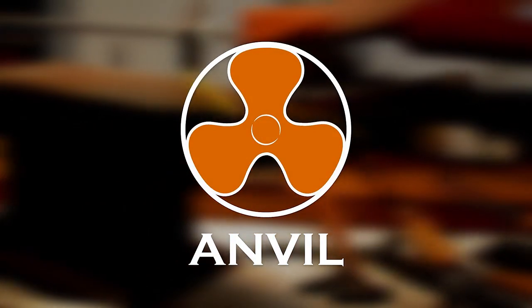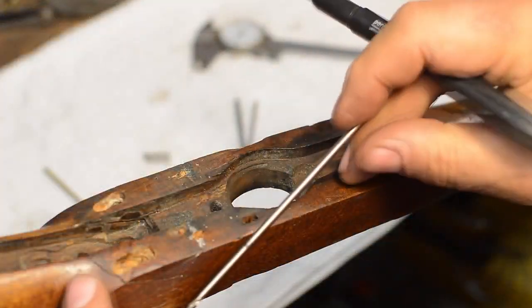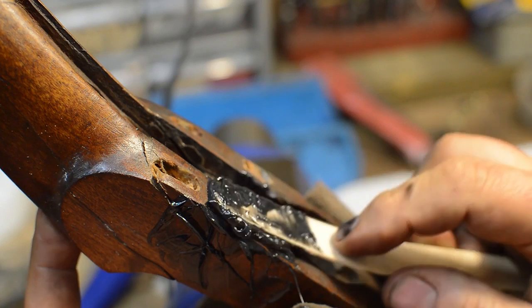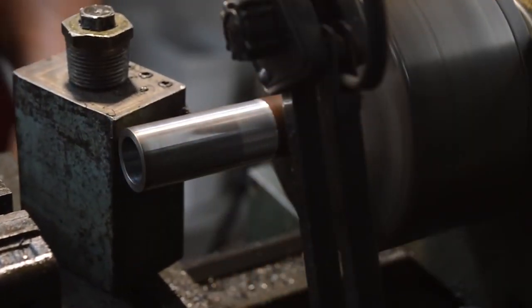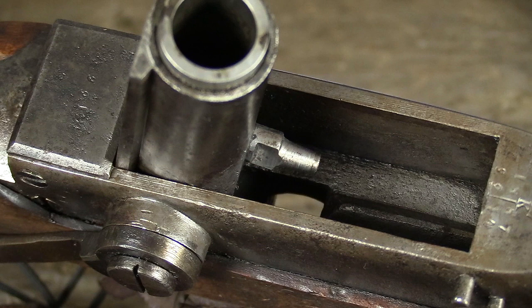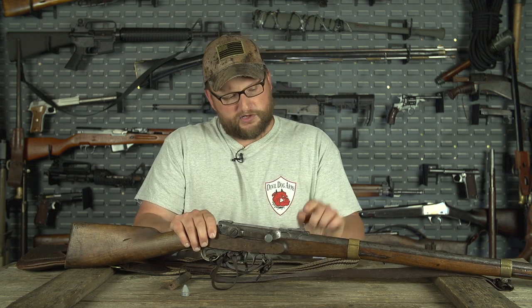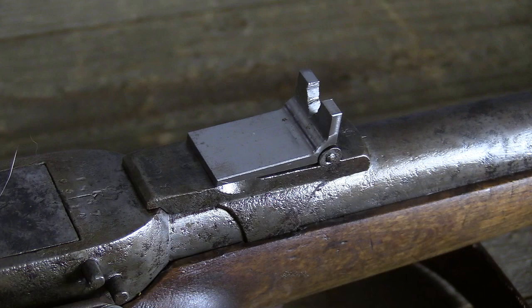We had Mark Novak come down, and he saw that my Kammerlader was in a relatively horrible state of disrepair in terms of shootability. Mark took this rifle, worked his magic on it, fixed the stock, did a lot of structural things to help make it work, and he also resleeved the breech — you can see where he put a hardened chamber insert in here. He used Acraglas to hold everything in place, machined this out, resleeved it, and made a new nipple for the breech block. I also ordered a replacement rear sight from a fellow in Norway and crudely cut it down for hunting purposes.